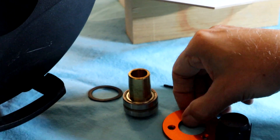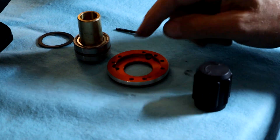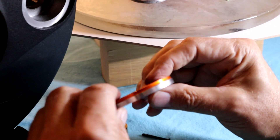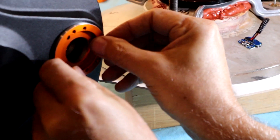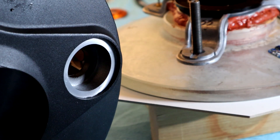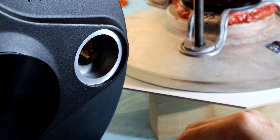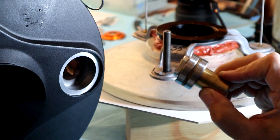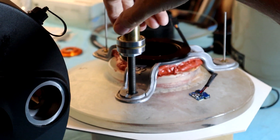The factory version puts this in and tightens a good clamp onto the bearings, which are fixed — the nut rotates when changing focus. When you switch to the motorized one, you take this plate and give it up, and put the other plate in its place so that you can mount the motor. As it turns out, the one they send you has a diameter that's too big for this plate to mount inside and seat on the reference surface — that's the clamping surface for the bearing. So when you clamp it in the original configuration, you don't actually get a tight clamp on these bearings.